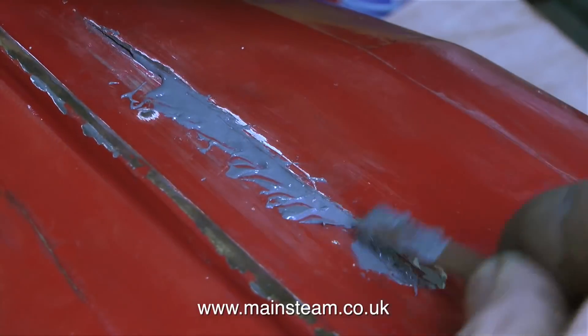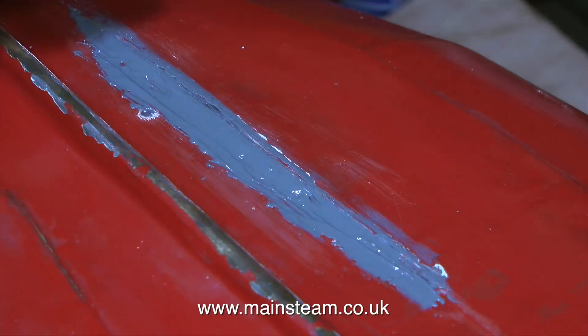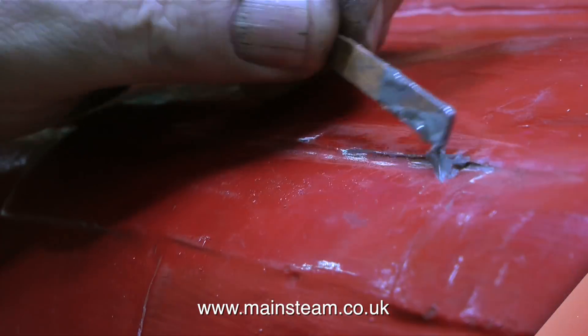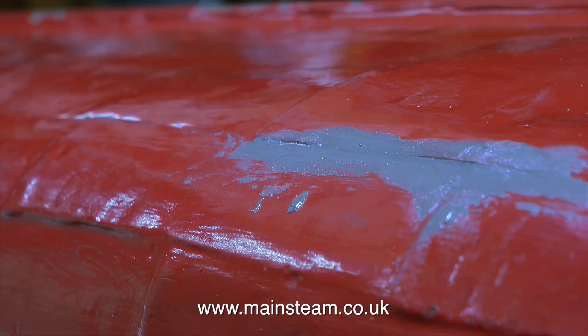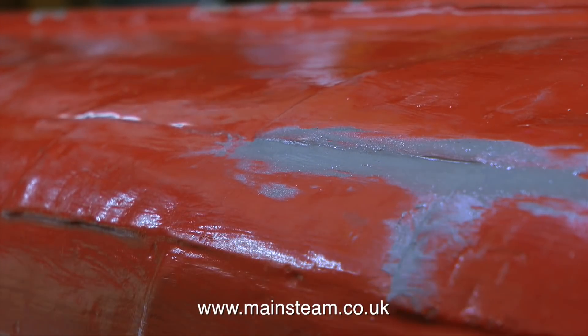There are two definite areas underneath the hull where the plates have lifted. This is the worst part near the stern — using my small mahogany mixing stick I'm packing as much JB Weld into the gap as possible. Epoxy resin tends to spread as it cures, so hopefully it will spread even further into the gap. There's some less severe damage further along the hull which I'm also treating to JB Weld. If you've been watching this series, you'll know I've fully fiberglassed the inside of the hull using two layers of glass fiber woven tape, so it's very strong — but I don't want any water getting between the plates and the fiberglass layer.